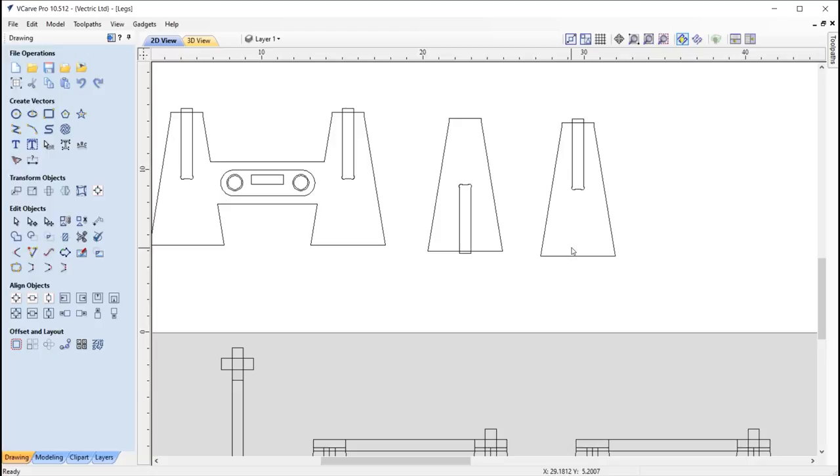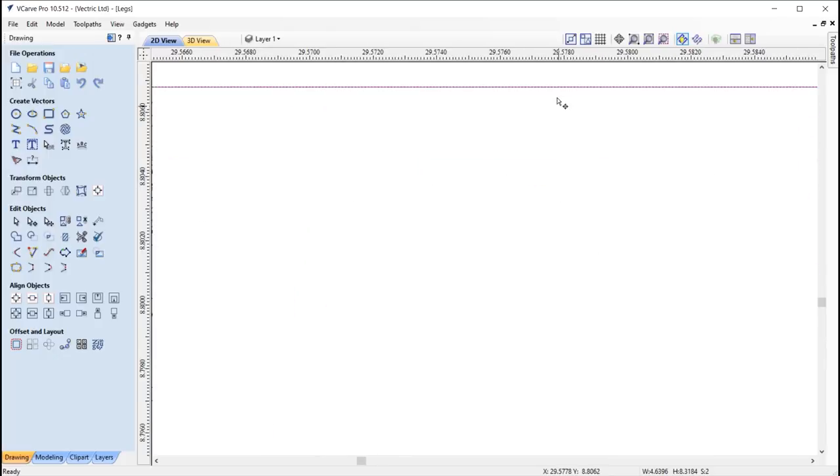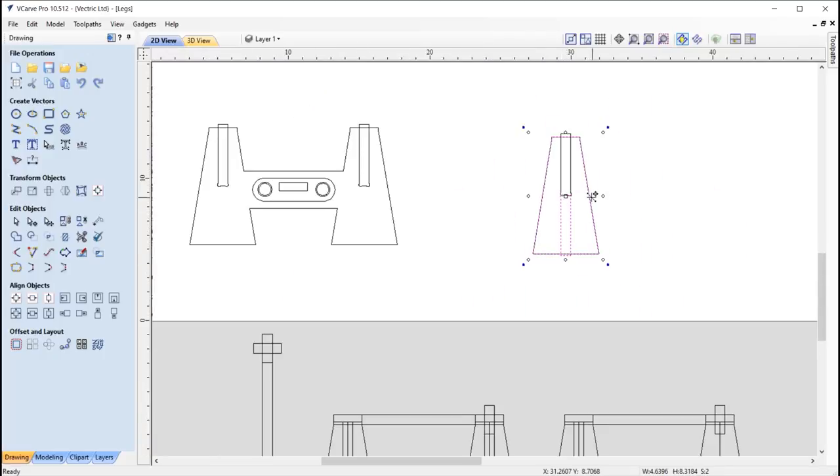Okay, so I'll put a link in the video on some very useful slot together projects that talk a little bit more in detail about how you get parts to line up. But generally, when we do this, you take a shape and the slots should meet at the same point. I like to just make them meet at a halfway point. It's generally quite easy to just cut slots in half, but you can choose where your slot finishes, as long as they both meet at the same point, where they pretty much lie on top of each other, it's going to work. Okay, so that's how that works.